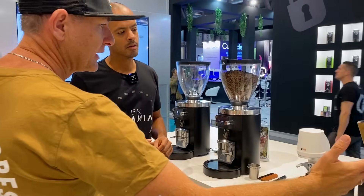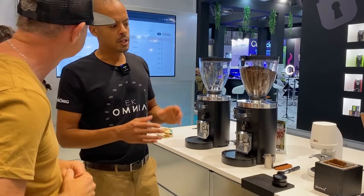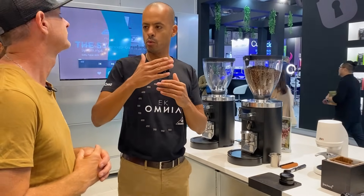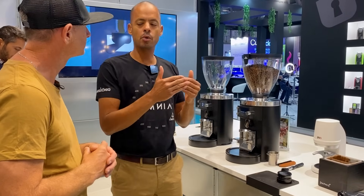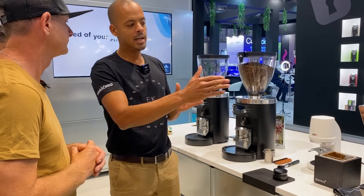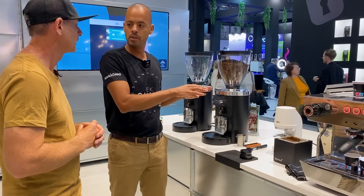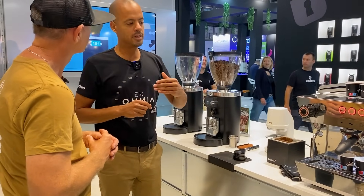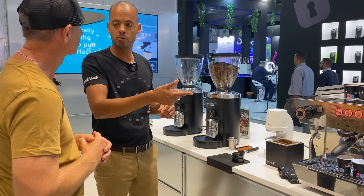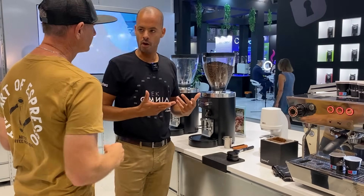We did an extraction and we're two seconds out. Because it's 22 seconds it's within the plus-or-minus two second bounds. There's always variability between machines and the grinder is always trying to assess for humidity or temperature changing across the day — that's what leads to some variance. The system checks a number of samples of data rather than making an immediate adjustment. If you suddenly get 30 seconds on one brew, it waits for another grind-brew event to check if the 30 seconds is repeating itself, then it does the adjustment. So it adjusts both the dose and the grind — taking so much of that thinking away from the barista.